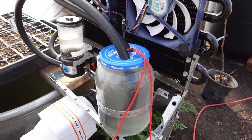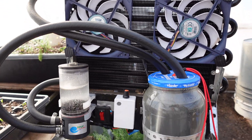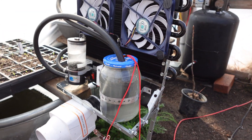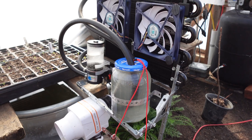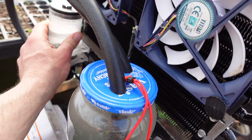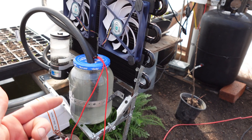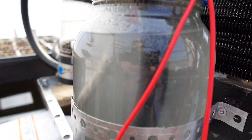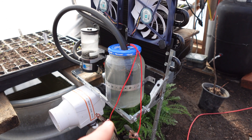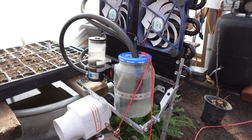To avoid freezing up and blowing out a closed system like this we have to use some type of coolant that is going to allow the expansion of frozen water, or we don't allow it to freeze at all. So we have to create our own coolant. This fluid looks a little cloudy because we're sitting with 33% vegetable glycerin and 66% water, and that drops the freezing point of the solution to about negative 40°C or negative 40°F.